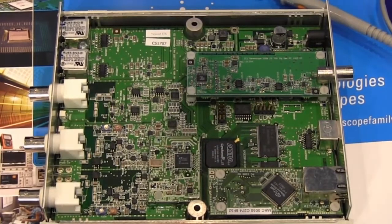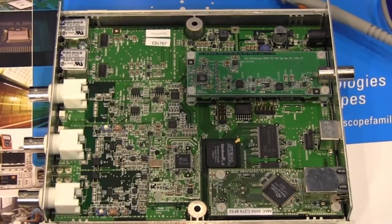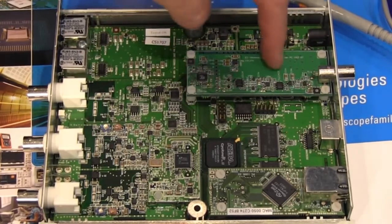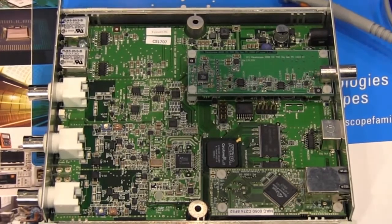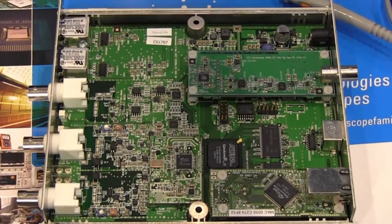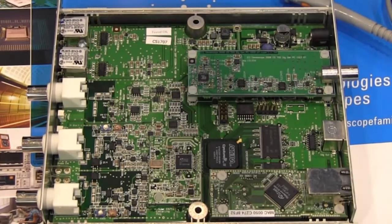Memory — SD RAM. It's got eight meg of sample memory. But it's not high sample rate — this one is only 100 mega samples per second. So it's pretty slow, but when you've got a 14-bit converter, that's the magic. Plus you've got a trigger that can capture almost anything. The Ethernet interface uses the Wiznet chip — hardware Ethernet. And here's a signal generator using a little Analog Devices DDS chip — just suits us down to the ground. There's a bit of power supply, and an aluminium case to stop the bad stuff getting in — shielded.